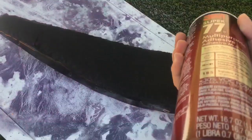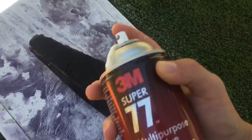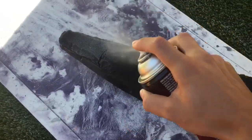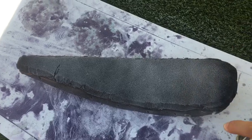The next step is the same as before. If you guys are wondering what glue I'm using, it's 3M Super 77. Same as before, you're just going to spray it down and stick them together. You want to let the glue tack up — maybe give it about five minutes — and then you can stick them together.